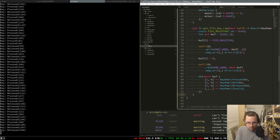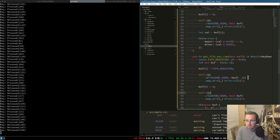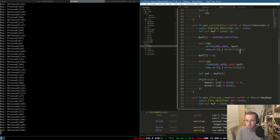Okay, I'm back. We did have one question. Someone was asking why I didn't do something like keyboard address 0x1, like this. Rust is really smart and realizes that this is a constant expression, so it moves that into the .text section, or that gets put in flash in the microcontroller. And the nrf52 in particular won't DMA directly out of flash. It has to DMA out of RAM.